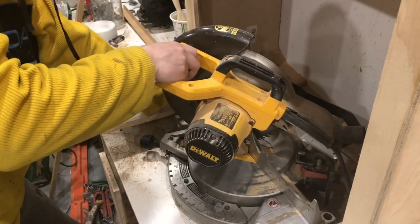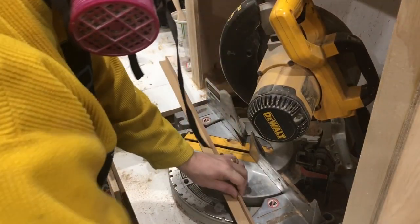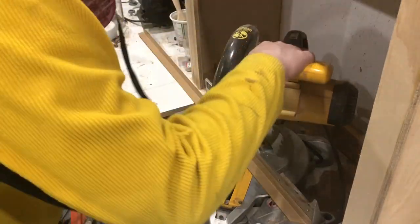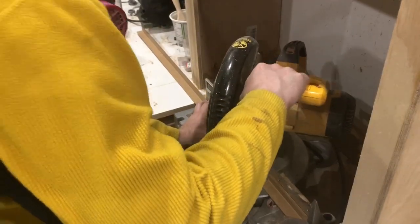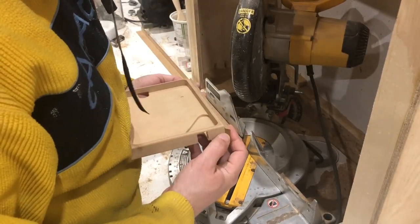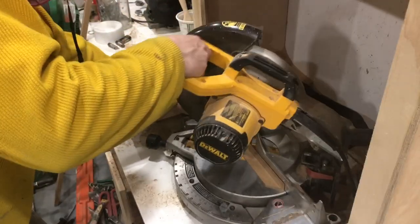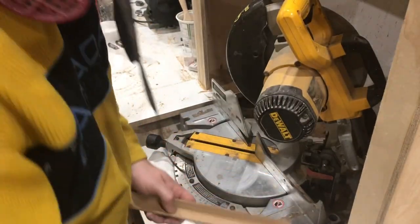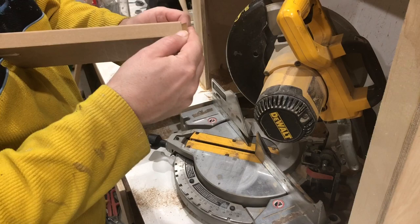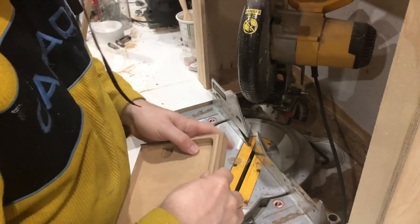You can see here the picture frame is just a three-quarter inch MDF, but I cut it into an L shape and it allows the insert to fit inside. The chop saw is doing the bulk of the work here — it's just 45-degree angles. This is just a picture frame, so four pieces and that's all I need to finish it. I'm using the tablet mount itself to do a quick check to make sure that it's the correct fit. I don't want it to be a really tight fit — I want it to be maybe a 64th or a little more big so that the insert can pull in and go out as needed, because it won't be fastened in by any means. It's just going to be a friction fit.